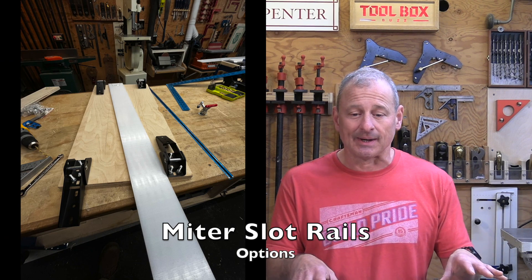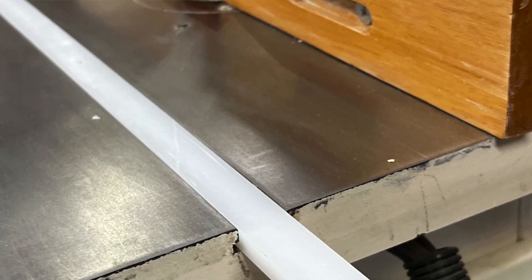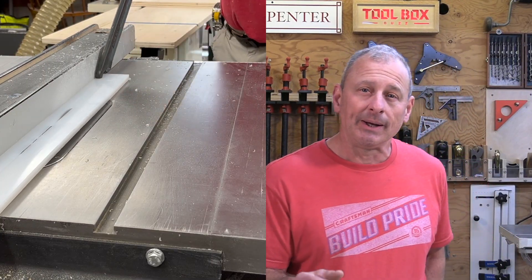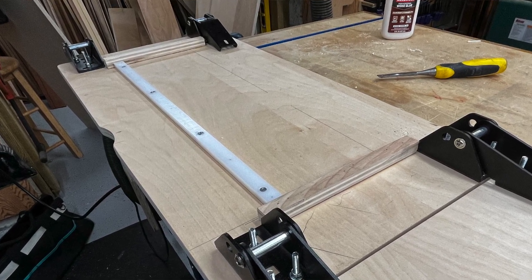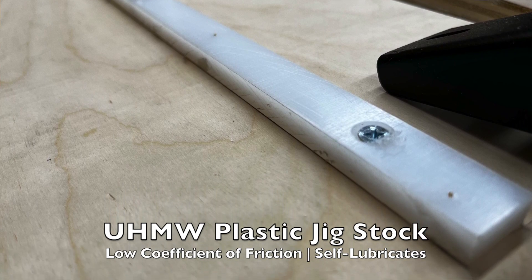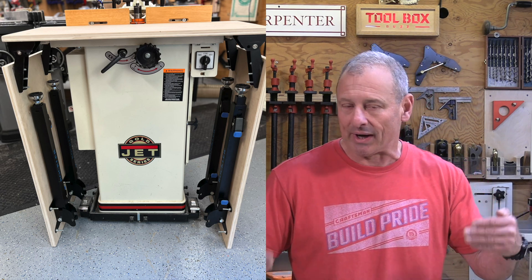In the past I would use oak or mahogany for my miter slot runners, but about a year ago I came across Rockler's plastic jig stock and aluminum miter slot stock. Their UHMW plastic jig stock is 4 inches by 24 inches by three-quarters-inch thick. UHMW stands for ultra-high molecular weight polyethylene polymer — it's a great material for making jigs and fixtures, with a low coefficient of friction and self-lubricating properties, making it a great choice for a miter slot slide. My table indexes into the shaper table; it doesn't slide, it just locks in as a keyway.